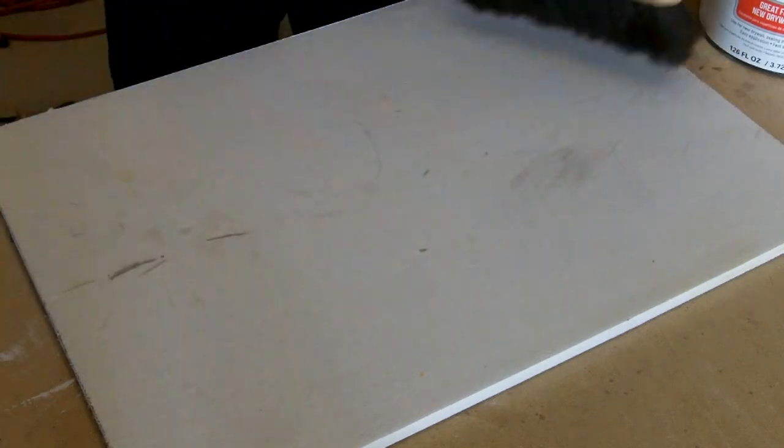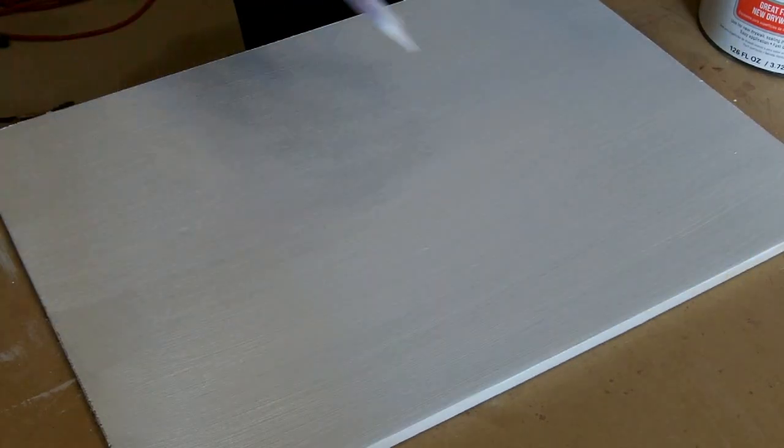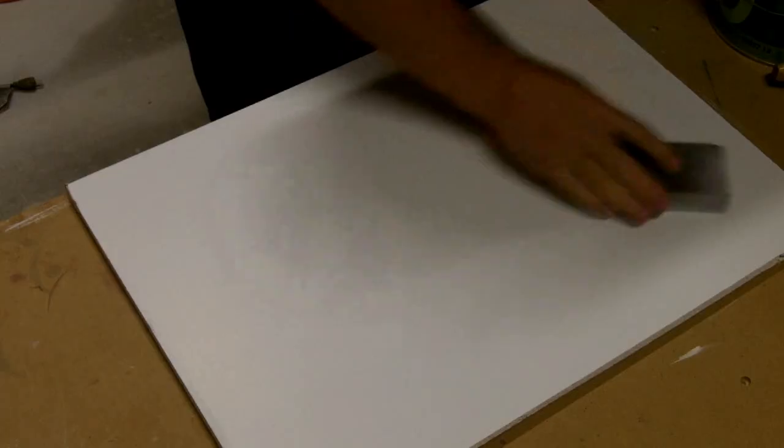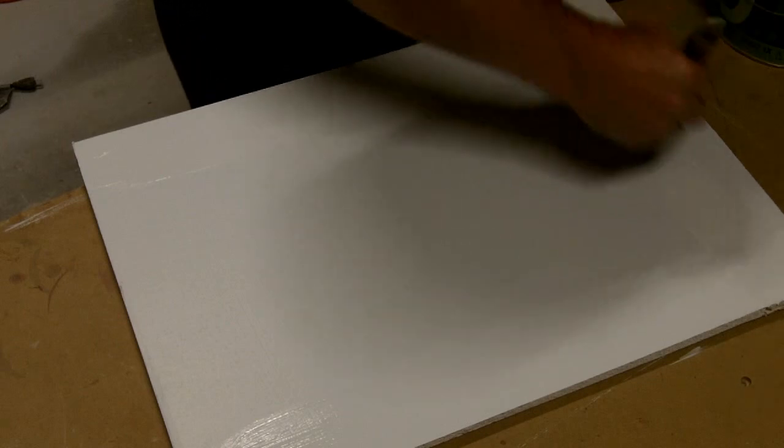For this test, I will prepare a scrap of drywall by applying one coat of PVA drywall primer, allow it to dry, sand, and apply two coats of semi-gloss trim paint while sanding between coats, and allow this to cure for 3 days.